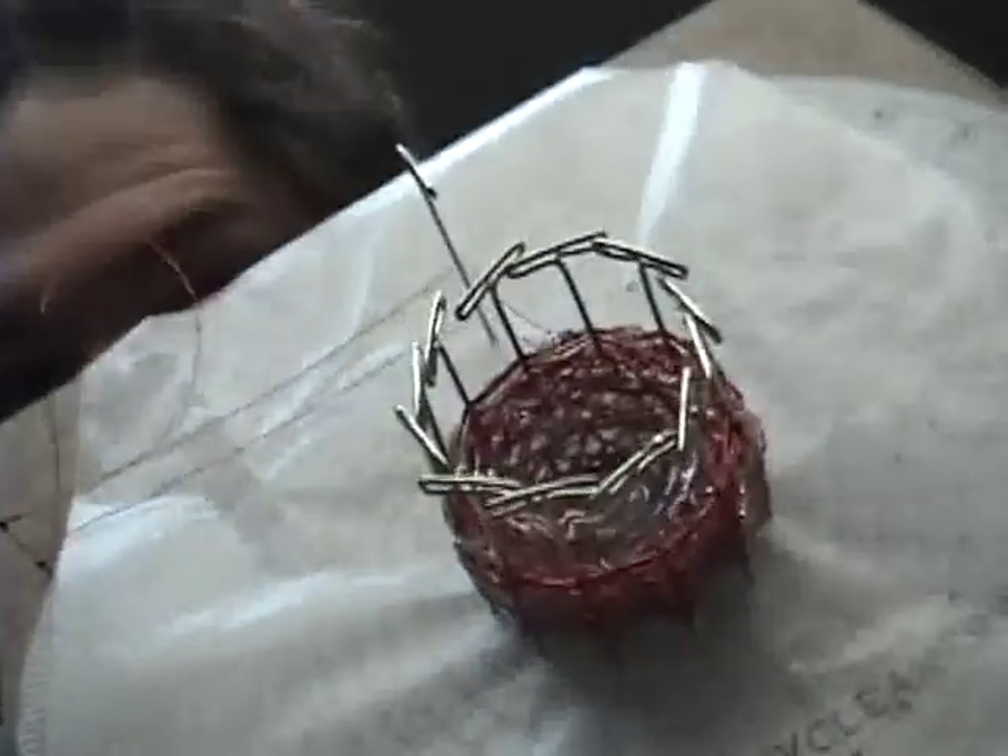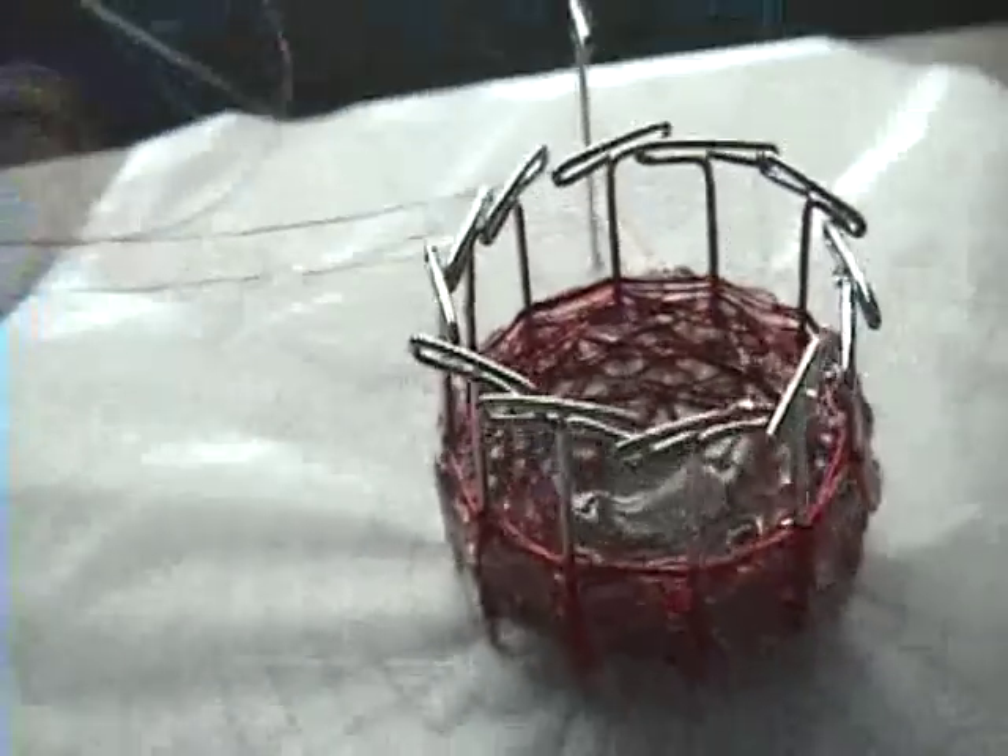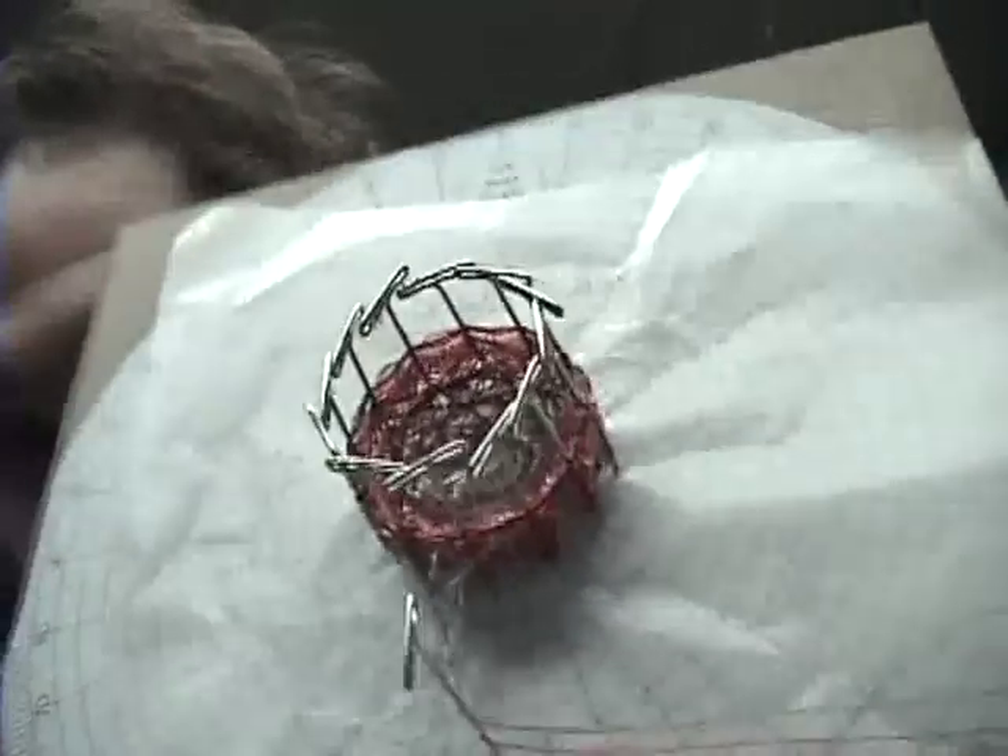Five wraps each pin — that's a lot. I believe this is number 26 wire, same as my other coils. I just got a small roll of it so I've been using it. I've got some hot glue on there, applied some on the sides, and dabbed some in the bottom and blew it down in there to stick it while it dries so we can take these pins out.